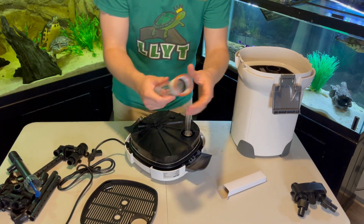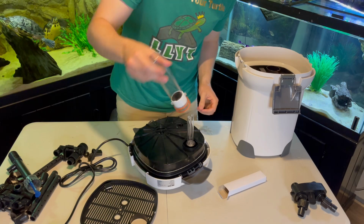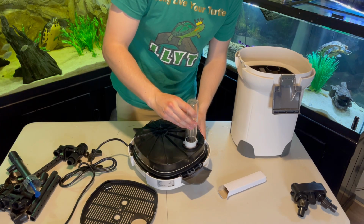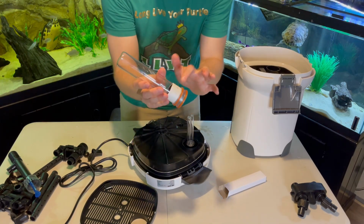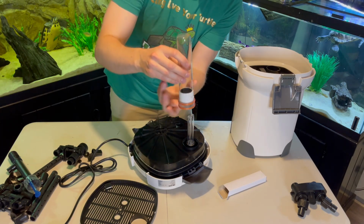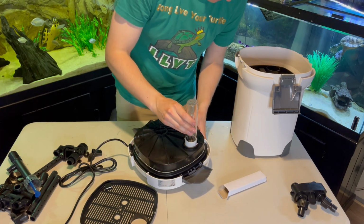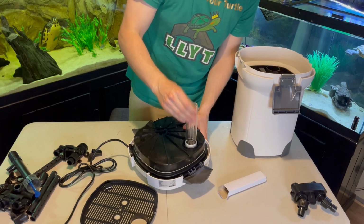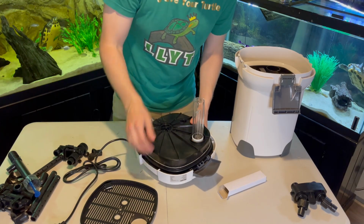Now this next part, you definitely don't wanna mess up. So you have these 2 O-rings on your crystal tube that's gonna protect your electricity going through your bulb here. So you're gonna lower that down. It's gonna kind of push into it. And then let me take it back out real quick. It's got these little tabs. What you wanna do is push it down far enough into the slot and then get the tab low enough that you can rotate it so it will hit a catch so you can't pull it out. And that will seal this whole space up to protect the bulb. So I now have it in there and it's now sealed. Give it a little pull to make sure it can't come out. Again, this is sealing from an electrical socket, so you do not want water getting in this.